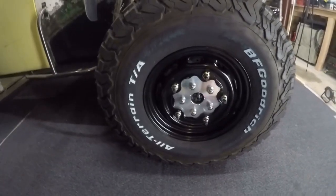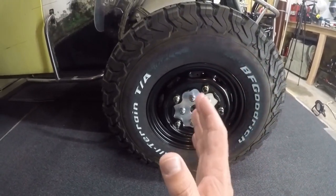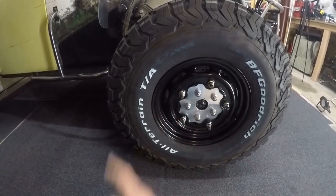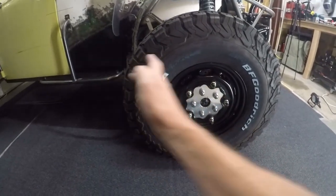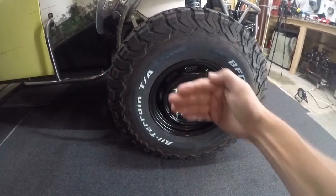What I knew was that I wanted to make it a couple of inches wider, and ironically — you won't hear this very often — I wanted to shorten the wheelbase. I made a wooden jig to hold it up straight. Then I took the tire and the wheel and I put them where I wanted it — where I wanted the wheelbase this way, and then where I wanted it for the track width.